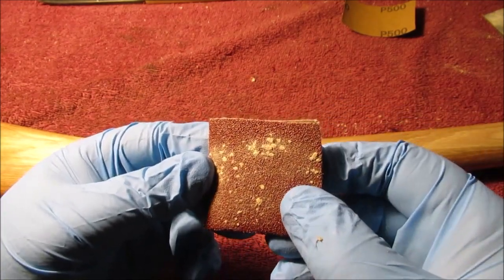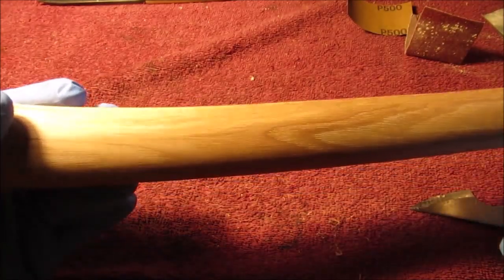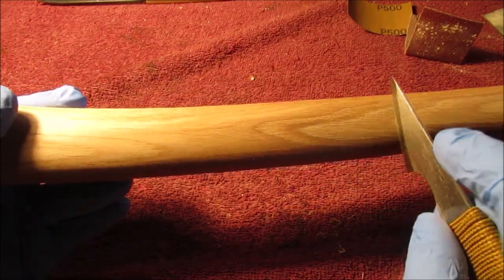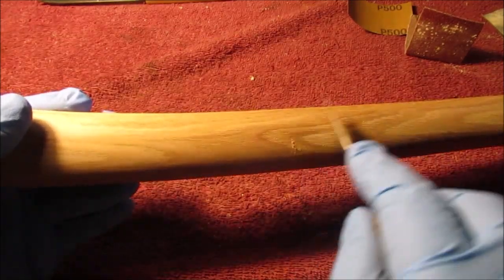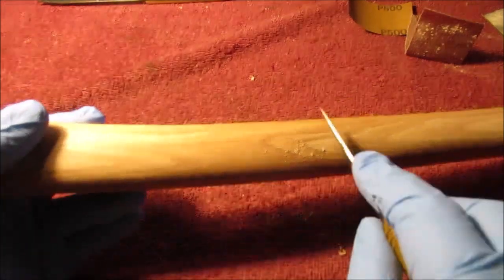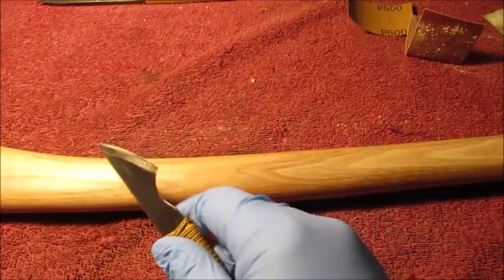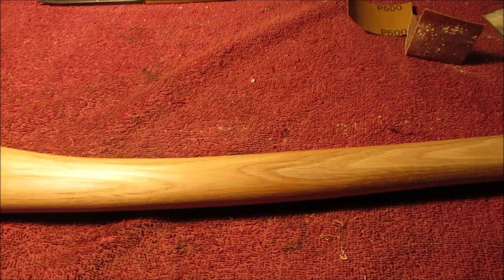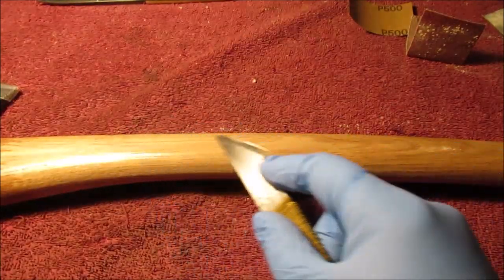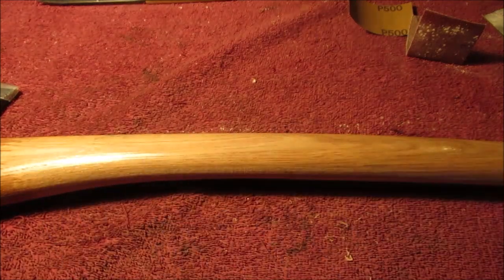You can see where the varnish is gummed and plugged. There are leftover varnish spots and places where the wood was raised up. When I was scraping, I was catching the wood where it was feathered, so I had to go back the other direction. When you're down to the wood you'll see that it's wood — that's why I'm careful. This side has been smoothed; now we go to the other side — it's still got the varnish on it. You can hear the difference.